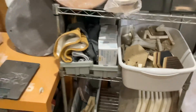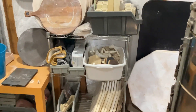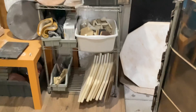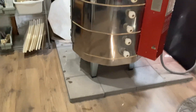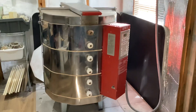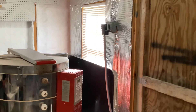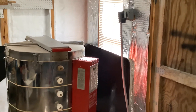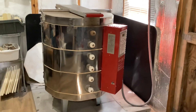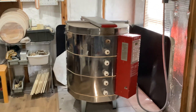I have my witness cones and my gloves. I no longer unload anything when it's hot enough that I have to use the gloves. I always check the plug before I start it, because if it works its way out somehow it can arc and catch on fire. I do not stay in my shop while it is firing.